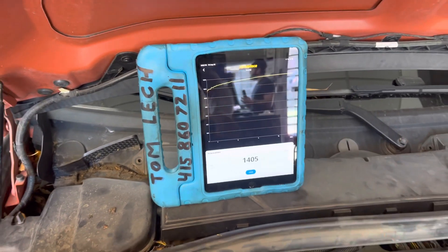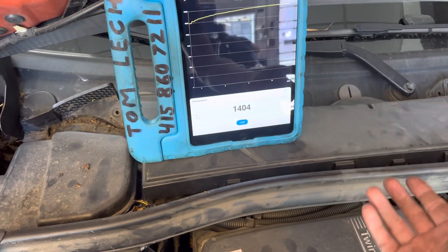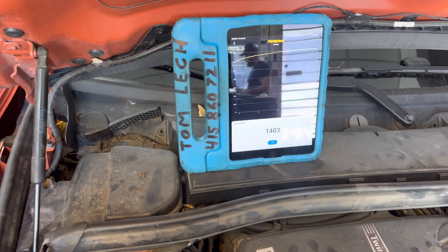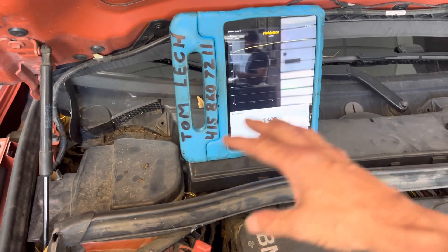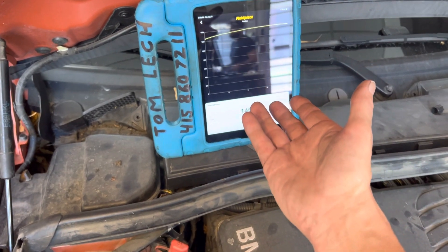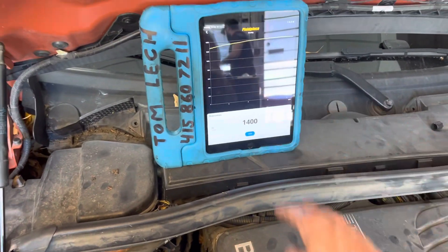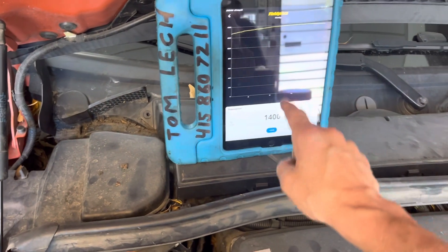As you see, it's coming to a level pretty soon. The second time you do it for another hour or two, you might notice that when it decays it stops at around 600 microns — just a guesstimate. 600 is not good enough; you haven't reached that 500 micron mark. Everybody's lazy and likes to go to 500 microns — for cars that's okay. But on refrigeration, you want to get down to 200 after raising and turning off. If you can get somewhere around 200 microns, that's excellent for hard copper pipe on a new system.